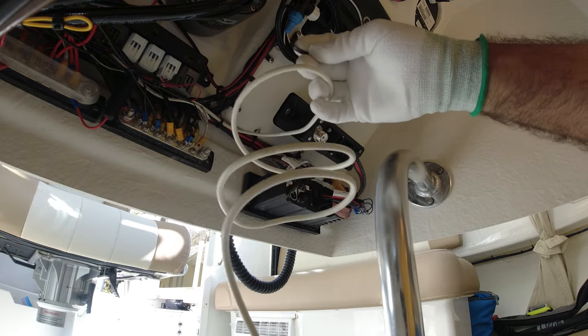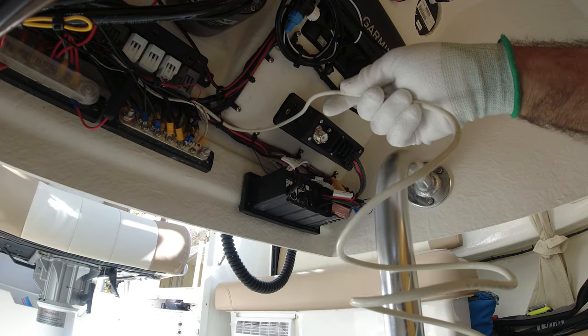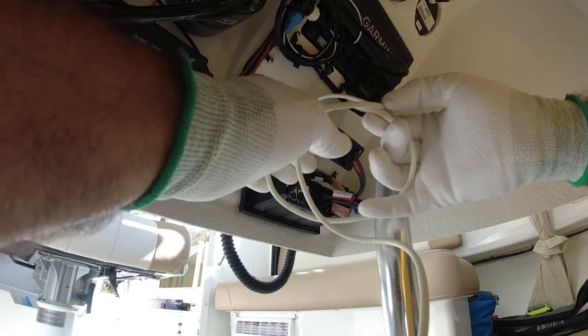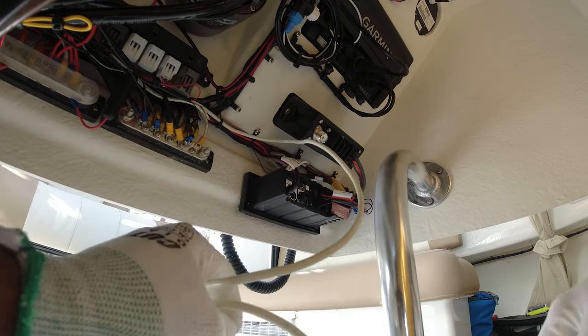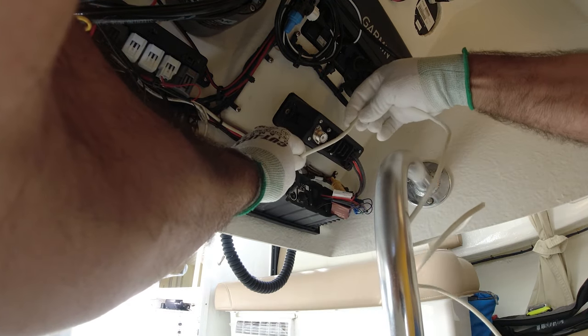All this winding does not help the reading of the antenna. You always want to leave a little bit of extra cable, but not so much that you have this big winding — by having this winding you're definitely losing frequency on the antenna. What I'm going to do is zip tie it through here and come around here like this.